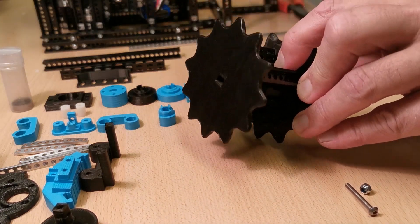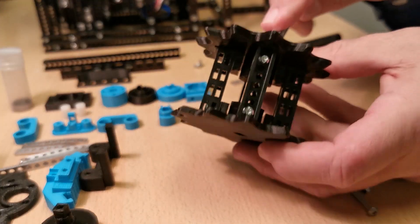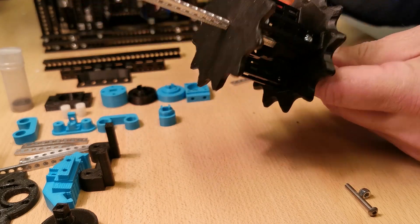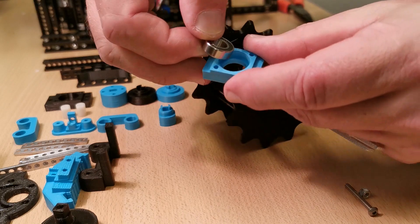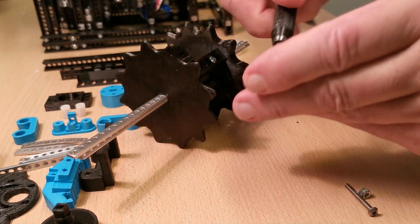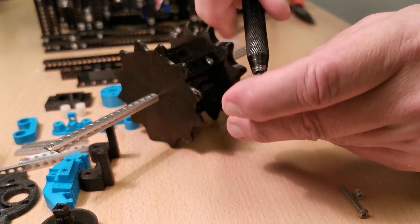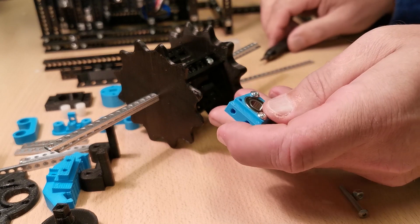Self threading into the plastic. Simply. Here I'm using two strip brackets, using them as an axle when later connecting the motor. I wanted to use ball bearings for these large belt gears, because I'm having a good, noiseless, long term operation. Also this time I'm fixing the ball bearings into a bracket with two bolts.